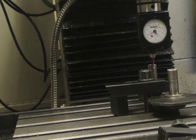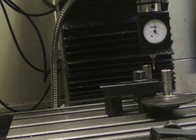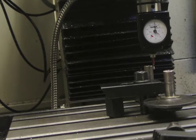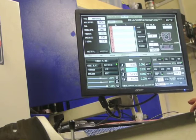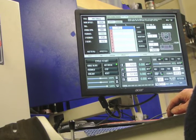And then I'll concentrate on the Y axis next. So here we go on the Y axis. Go along in the X axis, and then across in the Y. That's pretty close there. I reckon that's about maybe a tad more. I think that's good enough for centre on the Y axis. So once again go back up to the screen and I will set the Y on zero. Hit the enter — always hit the enter. And then I'll put my X and Y coordinates as zero.